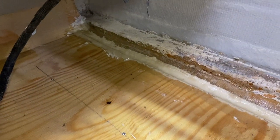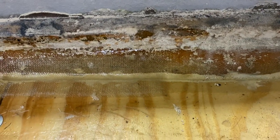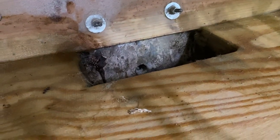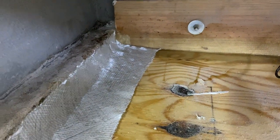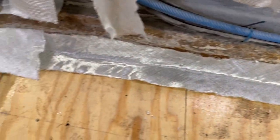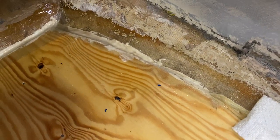I've got the first layer of fiberglass over top of the sealant — I used PL. I'll let that sit for 24 hours. I've got a layer of 1708 that I just finished. Even back here I've got one layer going into the bilge, tied into that transom support. I'm starting to cut out that second larger layer of 1708 that'll take up the rest of that space, which will probably be five or six pieces. I've got enough, it shouldn't be too bad.